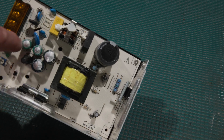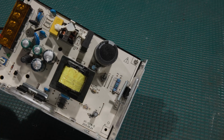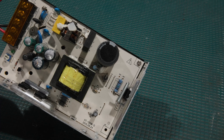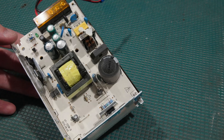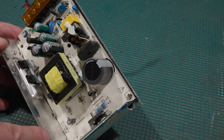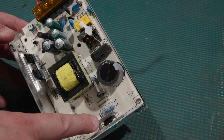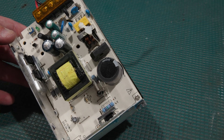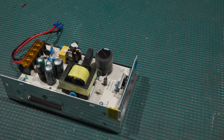As we expected, the output filters are gone — we'll have to replace the output filters in the power supply. Not a huge deal; we've got some in stock. I'm going to have to get these active components off the heat sink to get this board out of here. This clamp and that clamp will have to come off, and then we'll be able to get the power supply board out and get this worked on.